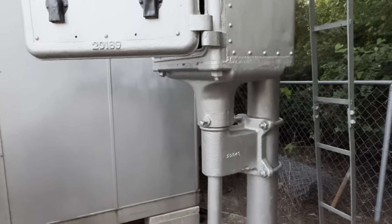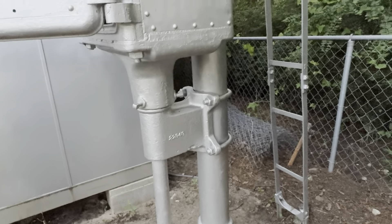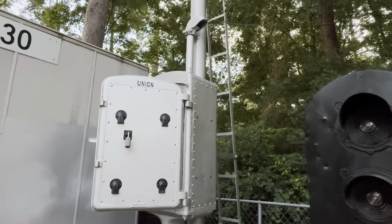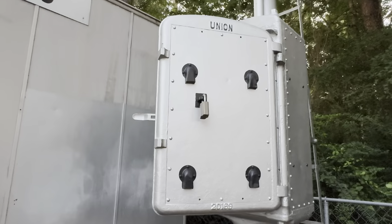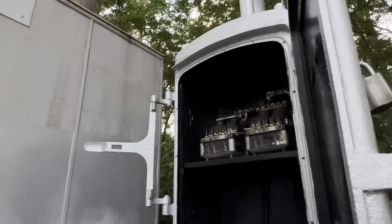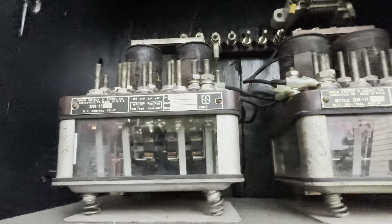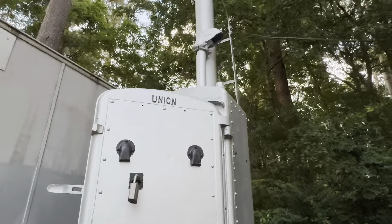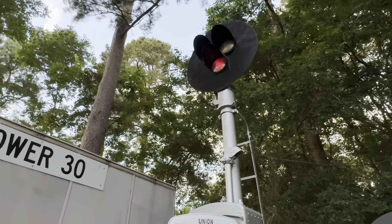It has another Union cabinet on it with the side mount — just like how the DW wigwags had a cabinet on the pole. So this very well could have held a wigwag at one time. Inside the cabinet we see the home and light-out relays for this light. The home relay switches between red and green; and since this was an interlocking signal it goes red-green-green rather than red-yellow-green — it was either stop or go, no approach.